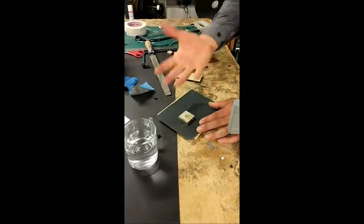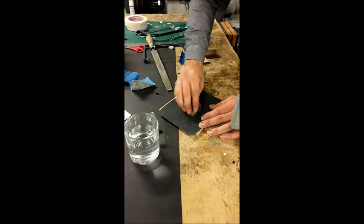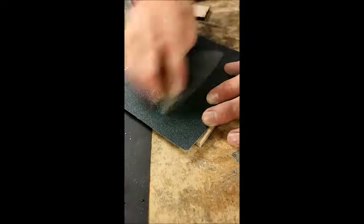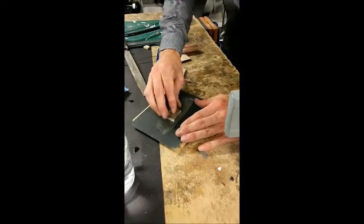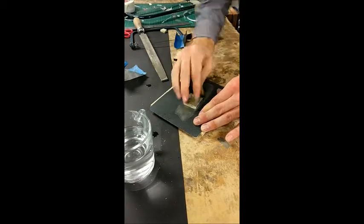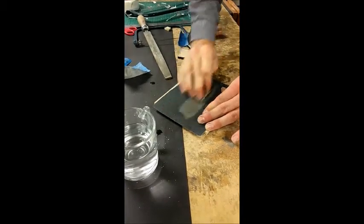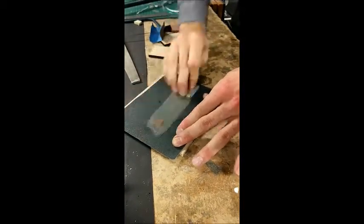This paper is quite rough, so I'd recommend using work gloves or holding the outside of the pewter with some paper to prevent your hands getting scratched. I'm working in one direction, going across — you can see that slurry developing and abrading the surface to make it smooth. I'll keep checking every now and again. I don't want to put too much pressure on because I don't want to end up with an angled surface. I can turn it every now and again, even counting strokes in each direction to make sure I don't do too many on one side. I've got a tiny bit more oxidation, so I'll keep going until we get to a finished outcome.